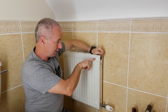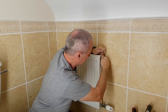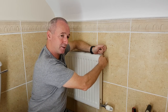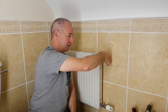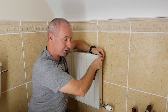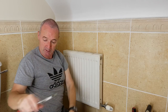You can see the difference in water level as it drains down. Here we go — putting the new Aladdin HV-30 in. If you can put a lid on a Coca-Cola bottle, you can put this in. Just find your thread and wind it in — that's it, it's in. Then get your adjustable spanner sized up for it and tighten it — not super pressure, remember it's held on the o-ring. That's it, it's on.